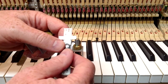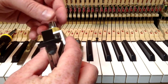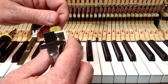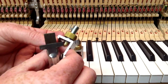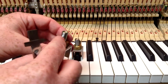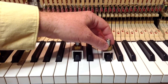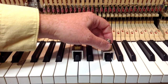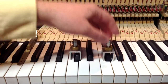I've got mine set at half an inch. You can see that it doesn't come all the way up, so I'm going to have to raise it a little — which is going to bring it up a little more. Right about there. So once you've got it at the right point, you kind of hold that cylinder in place and then lock down your collet so this isn't going to move at all. The set screw holds the float pin in place. Now everything's locked in at the height that you want it at and you can go in and use it. When you measure, you might have a slightly different measurement at the back than at the front, so you want to measure in the same place all the time — usually right at the front. I usually put the front edge of these feet right at the front edge of the sharp, and that gives you consistent feel.